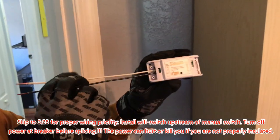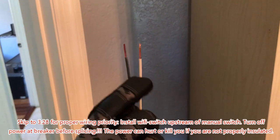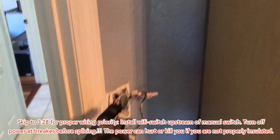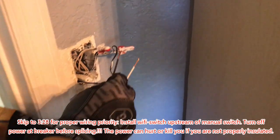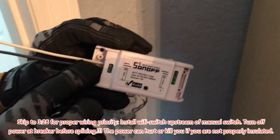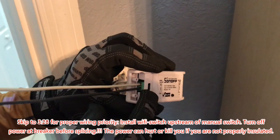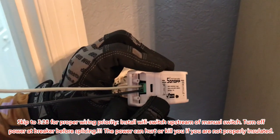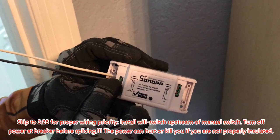What we've done here is we've taken some number 14 wire and cut off about one inch on the end — that's going to go into the power source, the white with the white neutral and the black with the black hot. On this side you only cut off about half an inch at the most to jab it into the receiving end and then tighten it with a very small flathead screwdriver.